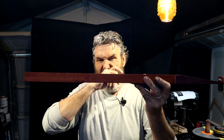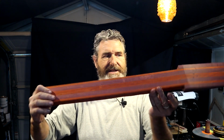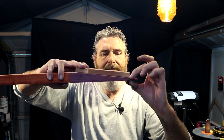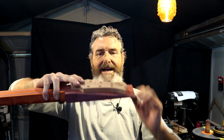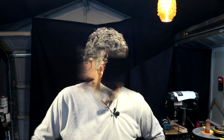I've sliced the thickness off of this neck and gotten rid of the truss rod slot that I had cut with the access in the headstock. Now, I don't know if you guys can see what that's done. I don't have enough thickness right here in this headstock to cover the 13.5 to 14 millimeter thickness I want on the headstock. But, you know, I had mentioned veneering the front of my headstock with walnut or maple or whatever.